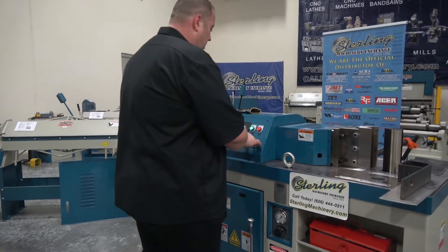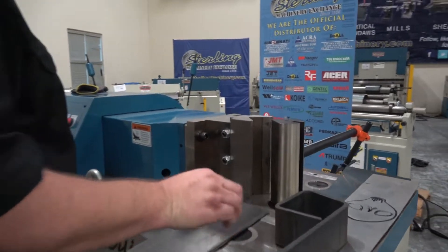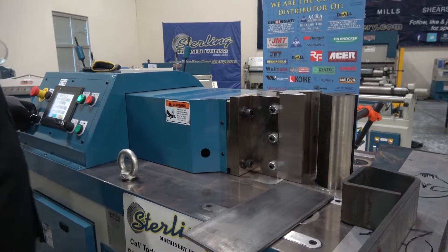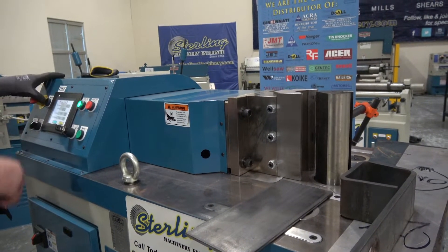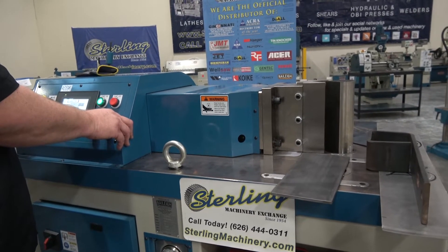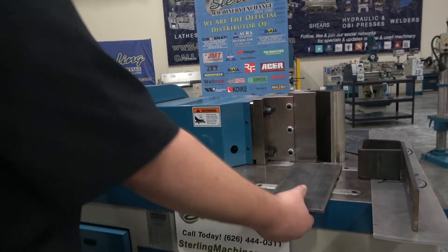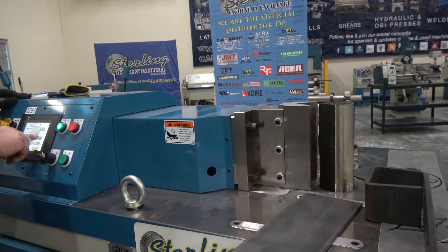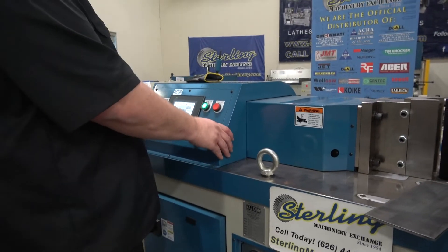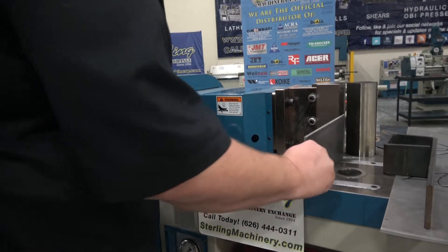We'll set this back to jog and bring it in. Here's a piece we're going to bend — nice thick plate, something we previously made on this machine. We want to be able to get our material in there each time. That's a pretty good spot; we'll set that as our forward. Now we'll bring it back to where we want to set it — that's a good spot. We'll hit the back spot and save that. We'll put it on normal; you can try it in manual mode with your hand. You see we got right to where we needed to be, take your hand off and we're right back to where we wanted to start from.